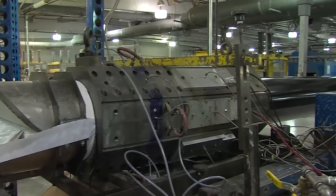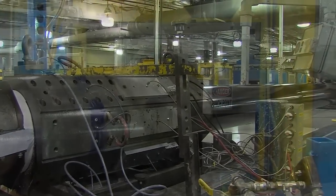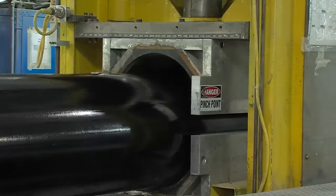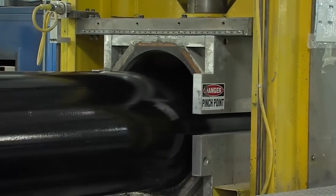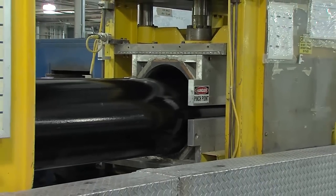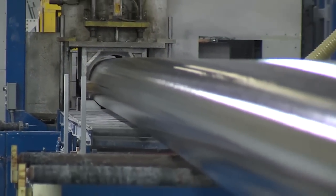The resin is injected under high pressure into the die. The resin is initiated by the thermal decomposition process. The initiator is heated until a chemical bond disassociation produces two radicals. The chain continues to build until the monomer is used, resulting in a cured resin.